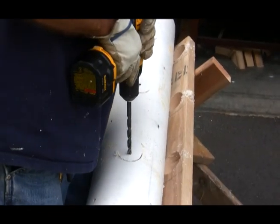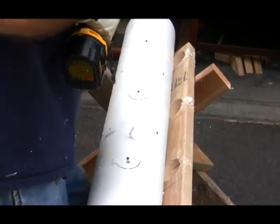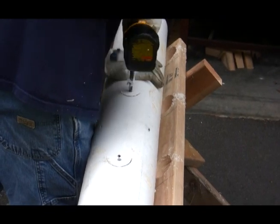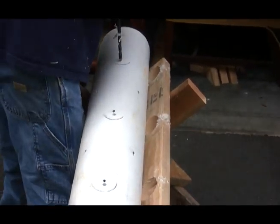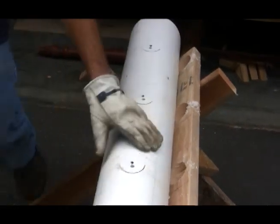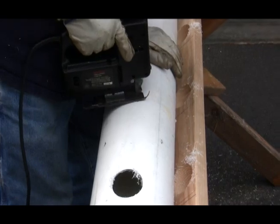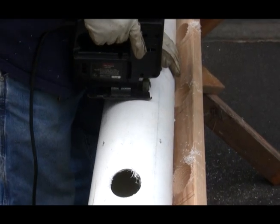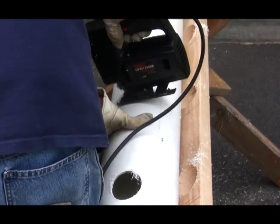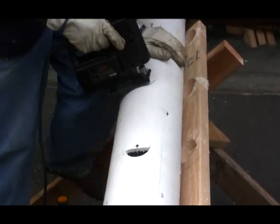I'm using a drill bit that's quite a bit bigger than the jigsaw blade, and I'm also cutting below the drill guide hole. The drill guide hole stays intact completely after I use the jigsaw, because I want that drill guide hole to guide me throughout the entire process — including finishing the hole — so I don't cut through the drill guide hole with the larger drill that I use for the jigsaw.